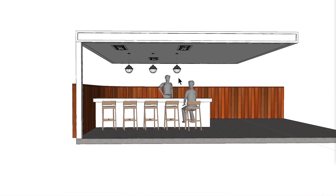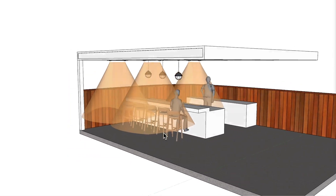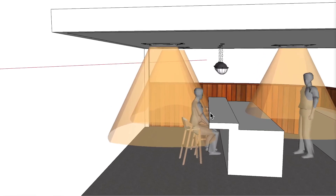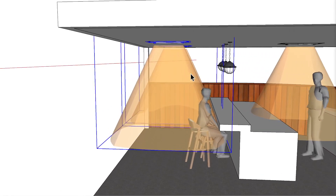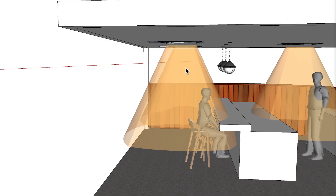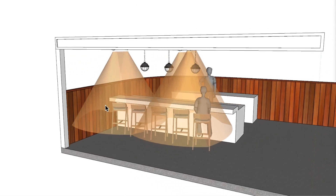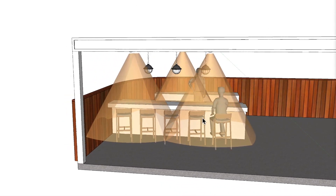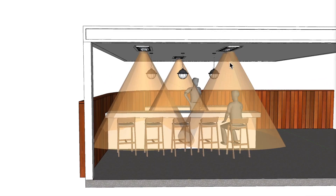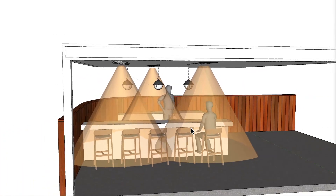This is the three 3,000 watt WD model flush mount configuration. Looking at the footprint of heat, it's really good. However, we're not capturing the bar as much as we'd like. It might be a better idea to move these two units about 12 inches to the right, which gives a better footprint of heat. At bar stool sitting height, you don't want something too hot. Even 3,000 watt WD models with two elements may warrant a control system.